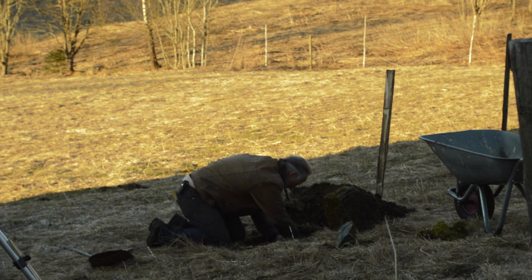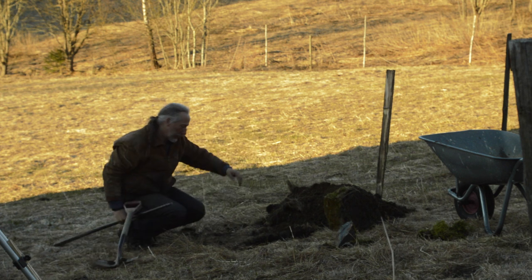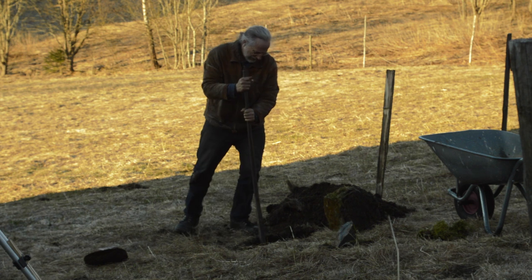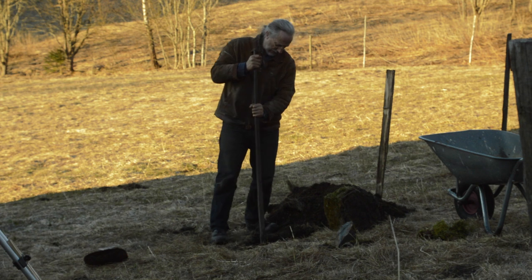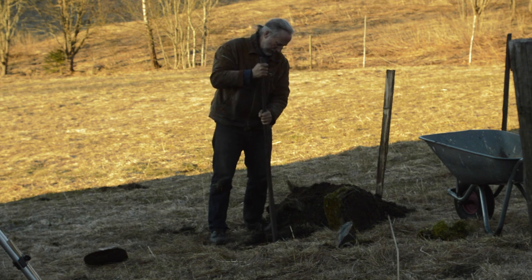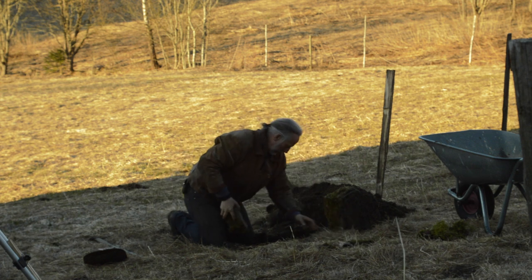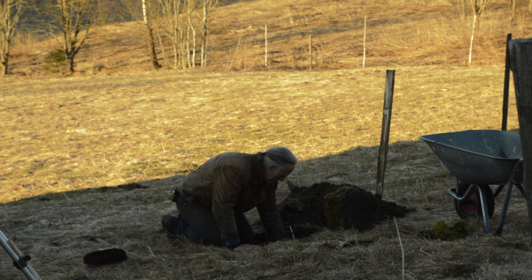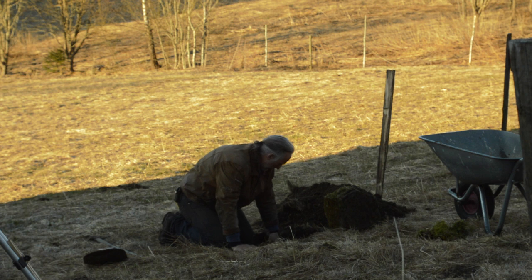So under any circumstances, this foundation has to be considered a kind of temporary thing, and it'll always have to be looked after, and perhaps the building adjusted and moved slightly. It should just be part of the maintenance routine to check the buildings for movement. They can be jacked up. That's one of the good things about this kind of joinery, is that it can handle some movement.